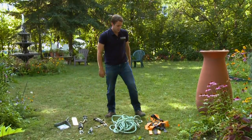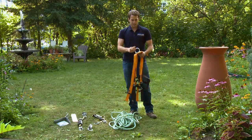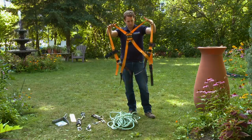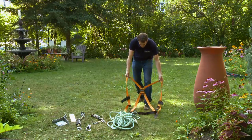Let's start first with the harness. To put on a harness properly, you're going to want to find the D-ring — the metal ring on the back — and take the yellow straps and the orange straps and hold it up. That should bring your foot straps and leg straps into view, so we're going to put this down and sort of walk into the harness.